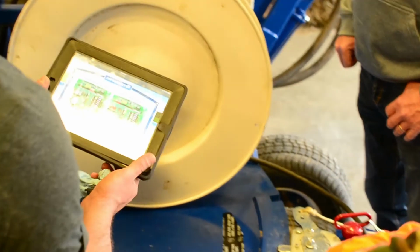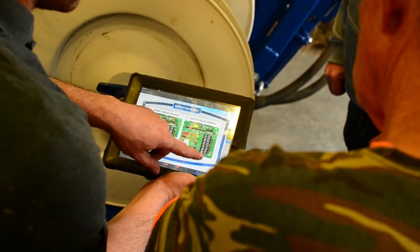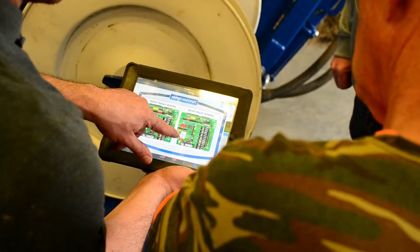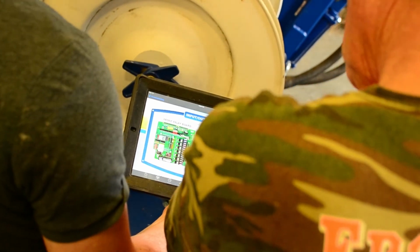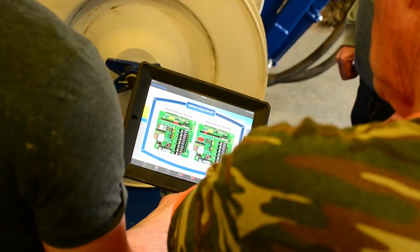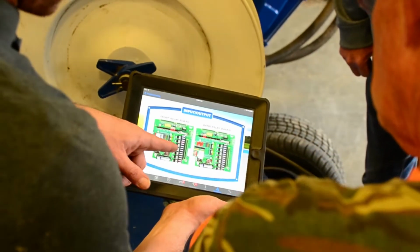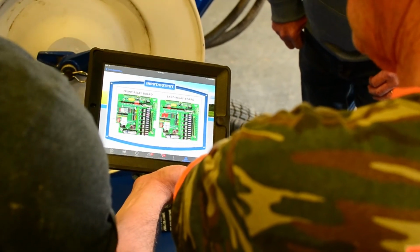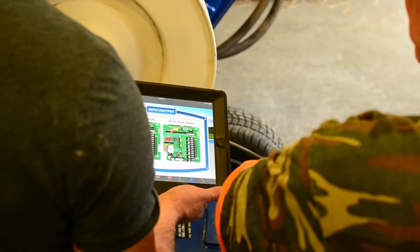The fuses, like there's a gray 2, purple 3. It's just signifying that something was on. But anyway, these boards are exactly the same. You just swap out a few fuses and then switch the dip switches if you want to swap boards. So it adds redundancy. If you get broke down and there's an input or output not working on your board, swap them and get going again. So a lot of redundancy. You have to change the dip switches? Dip switches and then a couple of the fuses. Literally, pull them out, swap them over, and you're good.